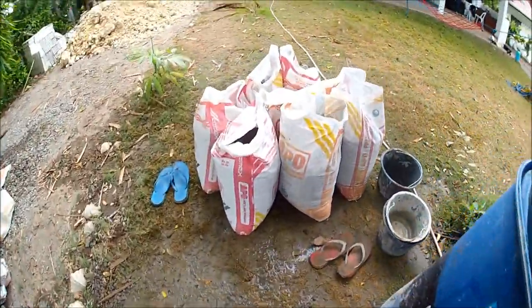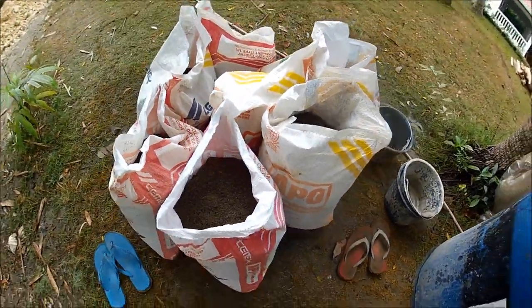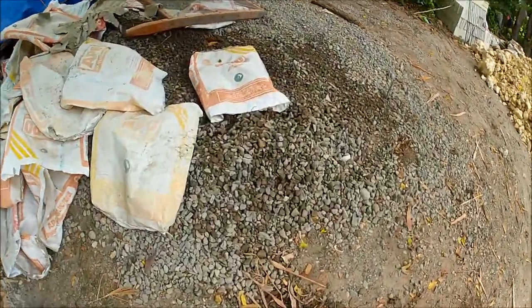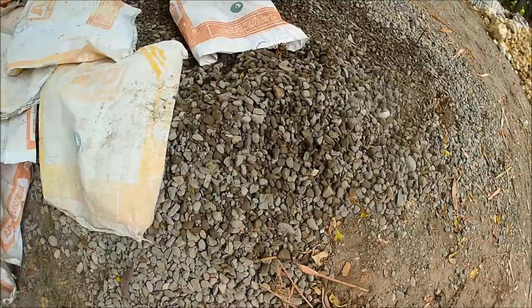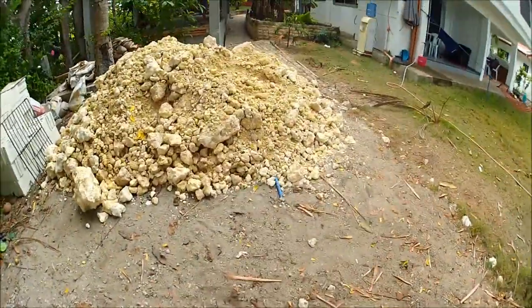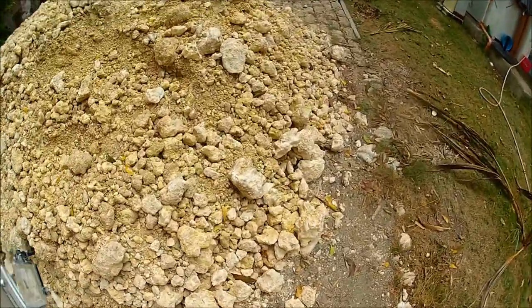And now, they have it pre-mixed. They have a certain amount of bags of sand. Naturally, they add cement to that. And they also have this 3/4 inch stone right here. And if they want to make mortar for the stucco, they use this screen here, which is about 1/8 by 1/4 inch mesh. And they use this for the substrate. It's crushed coral, same everywhere. Packs down nice with a little water.